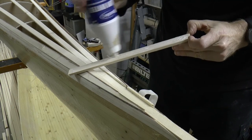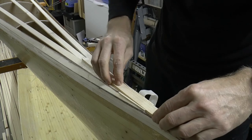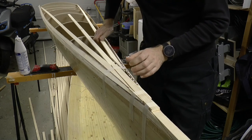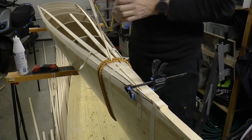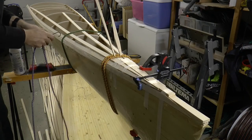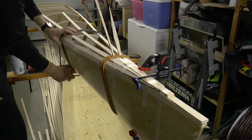As the sides are still too high compared to the middle strip, I add a short strip onto it — you have something to sand down into without opening a gap into the hull. I continue to add strips with spot glueing. With the leftovers from facing I can put pressure on the strip.